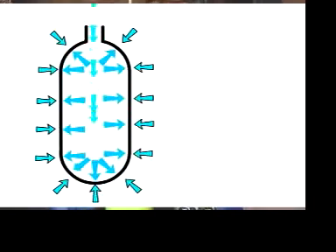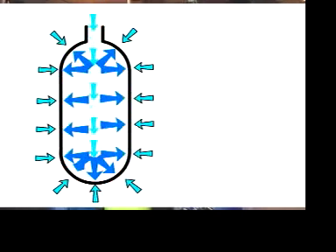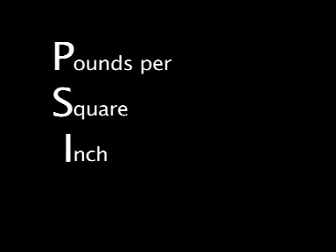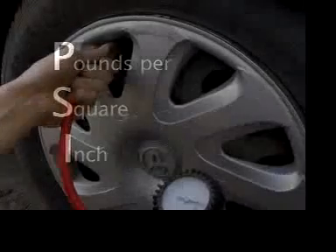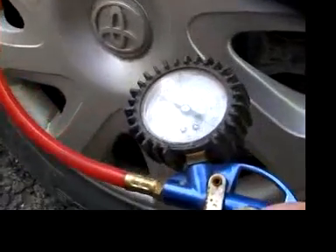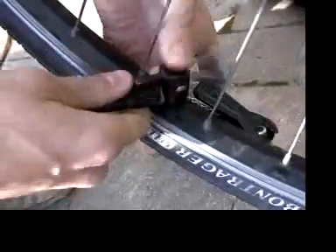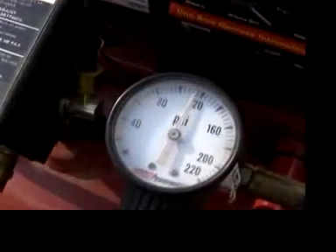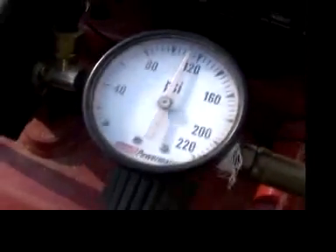As we push that air in to get it into that small of a space, we increase the pressure in the tank. The pressure goes from the surrounding pressure here on Earth up to about 3,000 PSI in the scuba tank. PSI stands for pounds per square inch. In your parent's car tire, we're talking about 35 PSI; a bicycle tire is about 65 PSI; and a home compressor might only go up to about 250 PSI. Our compressor here at Sunken Treasure will go up to 5,000 PSI — you can imagine how hard it's working to push all that air into that small space to get 50 cubic feet into the tank.